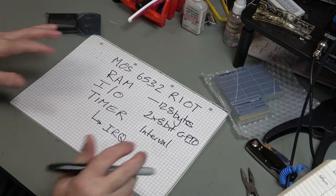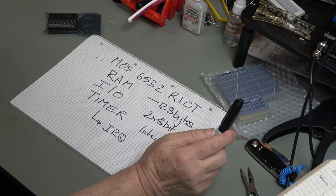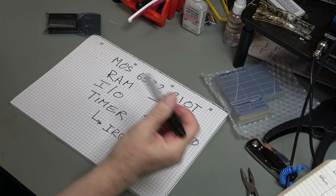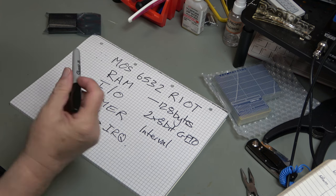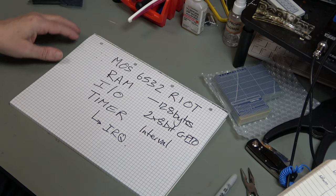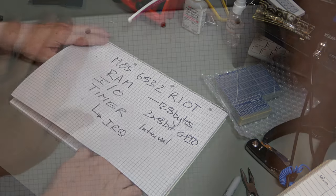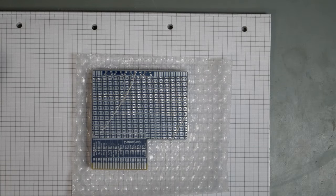Now, I thought about designing an Arduino shield for this, using something like an Arduino Mega, but we have to generate the clock frequency, we have to individually set clock pulses and clear clock pulses and do all the timing ourselves, and that is quite honestly a bit of a faff. I'm sure we could do it, but there is another way, and the other way involves this.